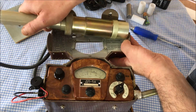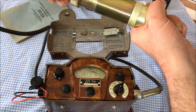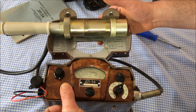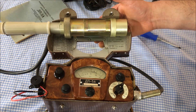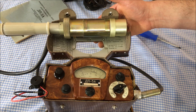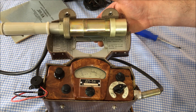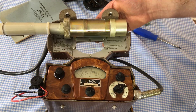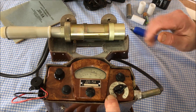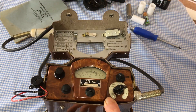To test the beta-blocking feature, I change the probe so it's covered, measuring gamma radiation only, then re-zero. We're getting essentially nothing, so I'll turn the scale down to the one-times scale. We're measuring about half, meaning there's a very small amount of secondary gamma radiation coming from this source. Everything seems to be working as expected and this unit is really good to go for field measurements. That's how to operate your vintage Soviet Russian DP-5A Geiger counter.